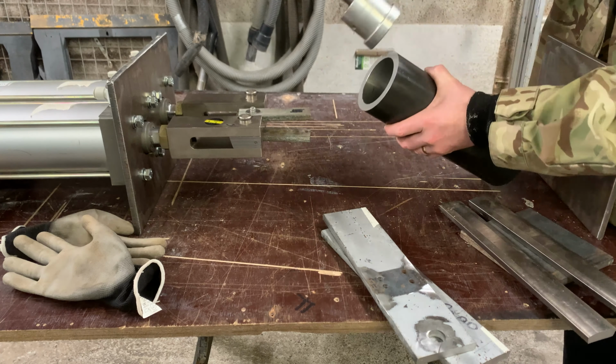I also want to make a little stand, or it's not so much a stand. I want to be able to repeat the position into this every time because I want to be able to remove that. So I'll probably think about putting four pins just sticking up from the steel plate so you can't misposition this. Let's mark a hole, bang a hole in there, and drill a few more holes in here, bolt this to the plate, and it's probably after that time to build the platform to actually hold this in a vertical position. So that's what we'll do now.